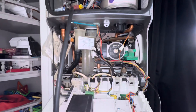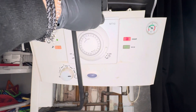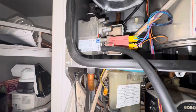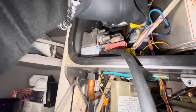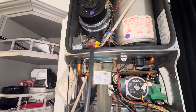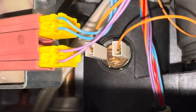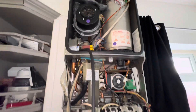The first thing to do is check whether the gas valve is opening up. Next is to check across the coils on these - so top two I'm getting 395, bottom one I'm getting 175, which is all the correct readings - I've got another video on this previously. There's no DC volts to either of these, but the reason is not the PCB - it is that. So you link that out and straight away the boiler fires up. But this creates a resistance and then the gas valve doesn't open up. So I'm going to go and get a new flue stat.